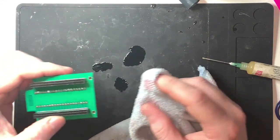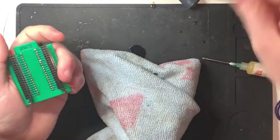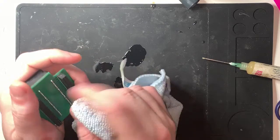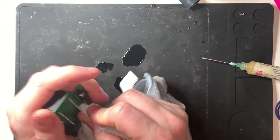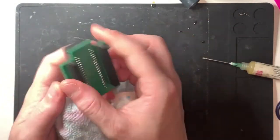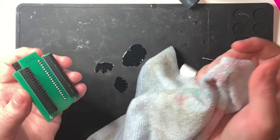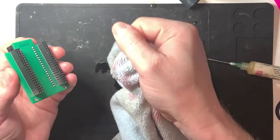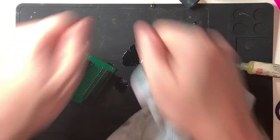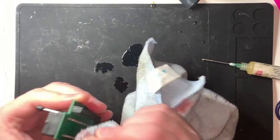You're right, the soldering iron temperatures on those are tricky, because they cool down as they use more gas, and they get hotter or cooler depending on the angle of them. So my tactic to deal with that is probably inadvisable, but my tactic is to make them really hot and try not to touch it. Run it hot and be quick, I suppose is what I'll try to do. Because I do more damage if the soldering iron's a little bit too cool and I hold it on for too long. If it's all over the gaff, I just crank it up to the max and just try to go, tst, tst, tst. It seems to work. I don't know if it works this time.